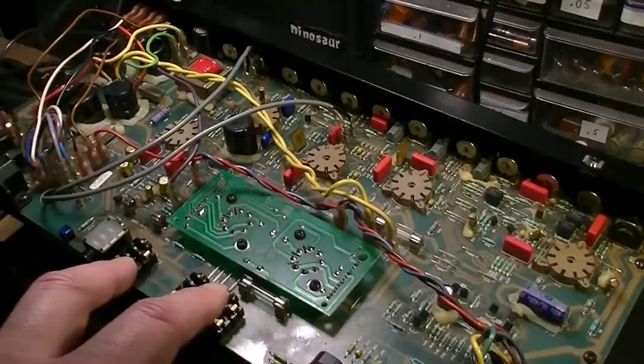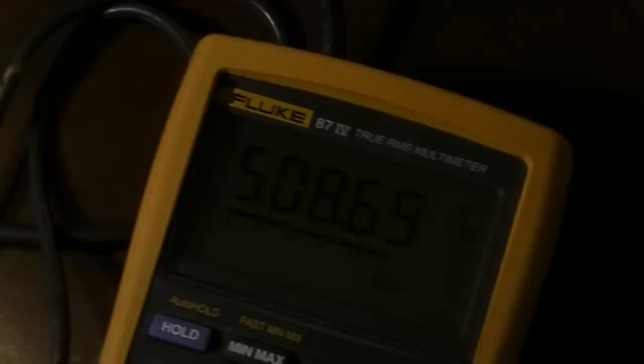So I got my voltage back, but the voltage at my plate is 508 volts, which is very high. The schematic calls for like 460 volts. And again, the overall consumption is supposed to be closer to 85 watts instead of 104 watts at idle. I am getting sound.